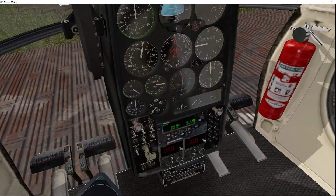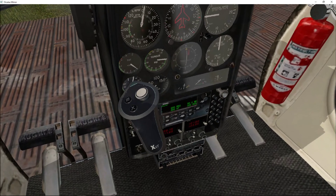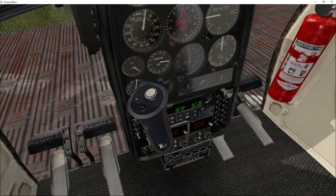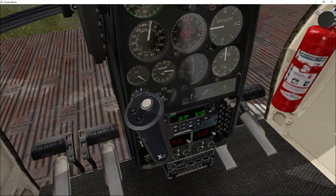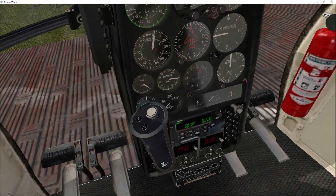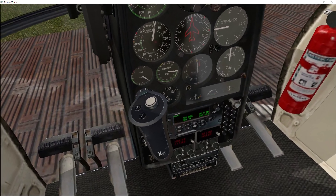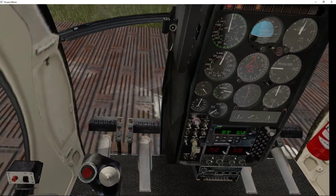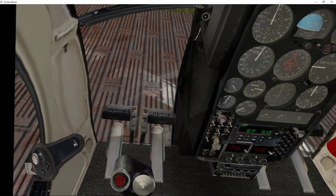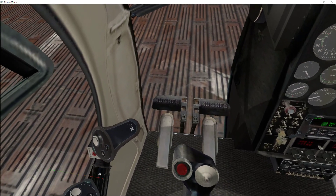It's just like EGT. So let that go to 15. I'm looking for the big needle. When it gets close to 10, now I start watching the small needle. With every 10 that it hits on this, the small needle makes one full revolution. So once it's hit 10 and makes a revolution, and then when it comes around to about the bottom here, that's 15. If it went around at 10 and then only comes to about here, that's only 12, and that's not good enough. It happens kind of quick, so you have to be on the ball. So I'm going to use two hands — grab the throttle with one and hit the starter with the other. And I'm just going to pay attention here: there's 10, 11, 12, 13, 14, 15 — going to go just like that.